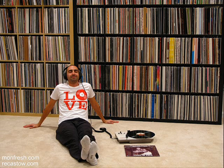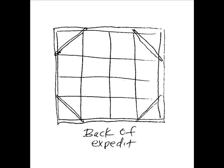And one other thing I want to mention, if you take a look at this second drawing, now this is the back of the unit. Now if you're going to have this standing away from a wall, you really should shore up the back. Now you can put one solid piece of, say, press board, which would be the best thing because it would be incredibly strong and rigid. Or you can just use these corner braces.